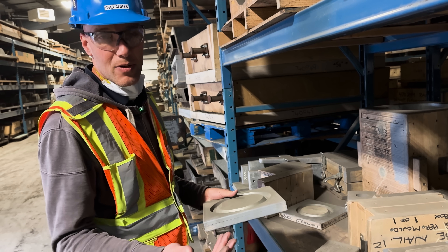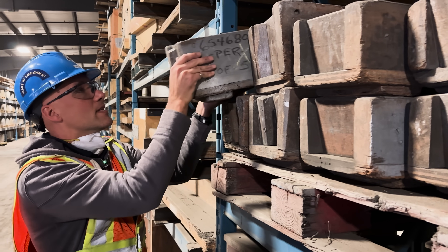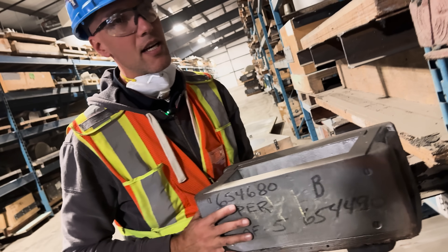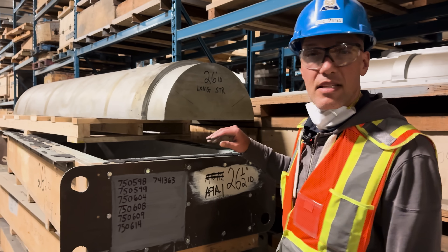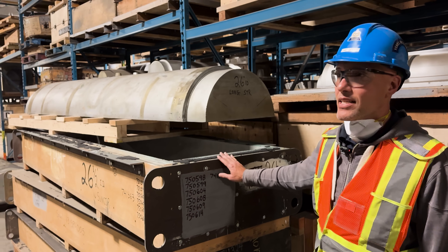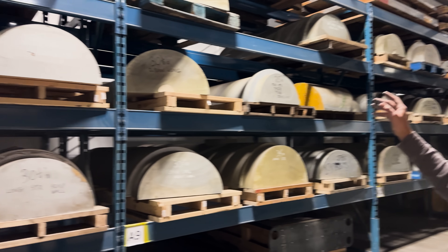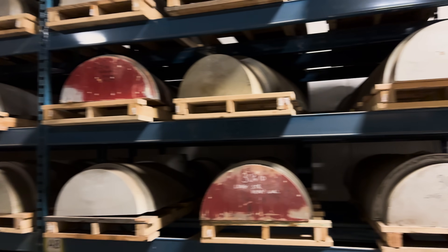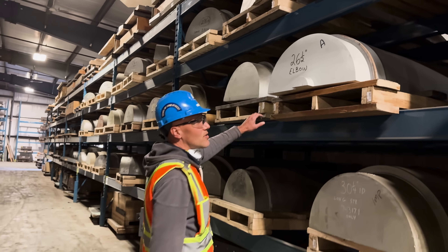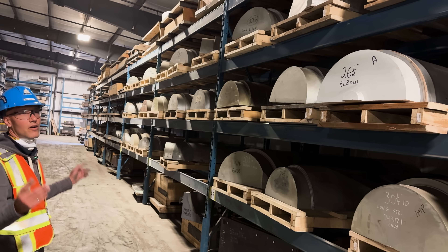A break-off core is just a little ring of sand that sits underneath the riser — it makes it easier to knock the riser off the casting during the breakout process. Some of these patterns are about 50 years old. This one gets filled with sand and makes the core for a lifting lug on a pump casing. This here is a pattern for the high chrome iron liner pipes that we make — the core box. And over here are all the different dimensions of pipes: straight pipes and elbow piping. This is a core for a 26.5 inch elbow.